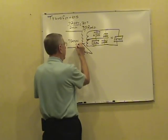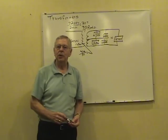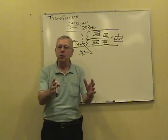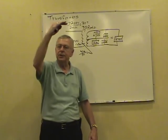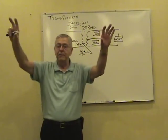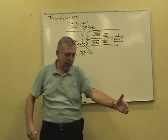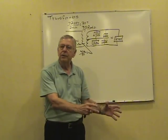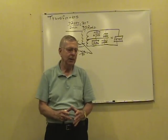Well, that's roughly, what, about 1.2 amps or so in the primary? That's why we use AC as a distribution system. Say to feed a hotel, over at the generating plant, they step that voltage up to a real high level, send it across the power lines, which are out in free air to begin with, dissipating heat real quick. Now, when they get back over to the hotel, they got to set another transformer to step it down to a usable voltage, probably.